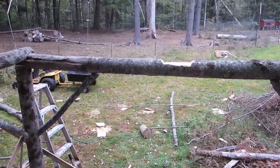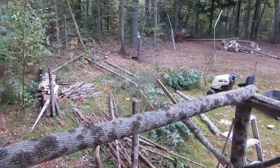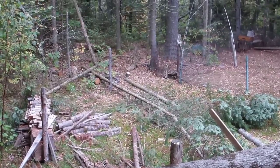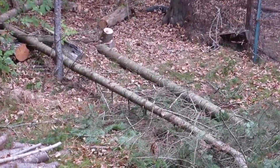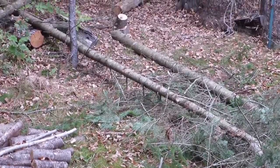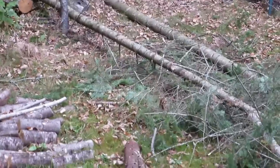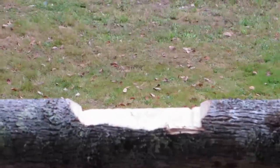I've actually cut my rafter material. Because I'm going to have to be up high on the ladder, I've cut down some nice, tall, straight, smaller fir for these rafters — running them a little longer to the front. I don't want to be up there trying to manhandle ash because it's incredibly heavy. The fir is a little more forgiving and lighter, but I think it'll work fine as a rafter. So that's where we're at at this point.